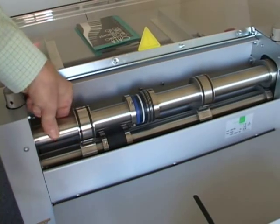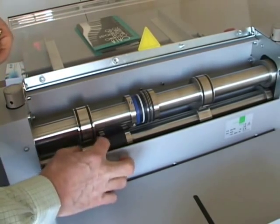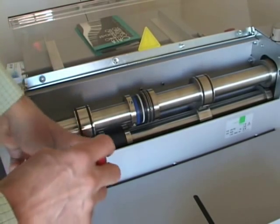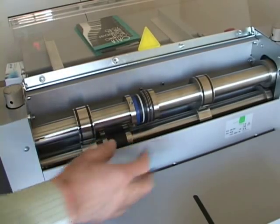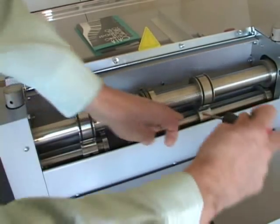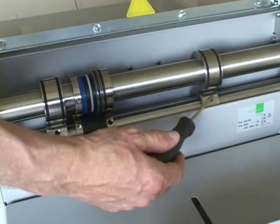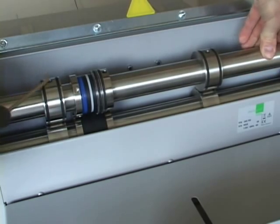3. Rotate the shafts exactly 180 degrees. 4. Now rotate all the loose collars on that opposite shaft so the Allens are at 3 o'clock and tighten. This will give you the 12 and 12 position. And you can check it by rotating it through a full revolution. As you reach 12 o'clock on the top shaft, the Allens on the bottom shaft should also be at 12.